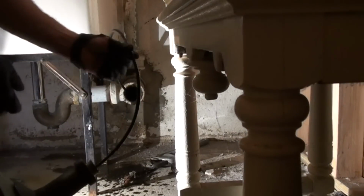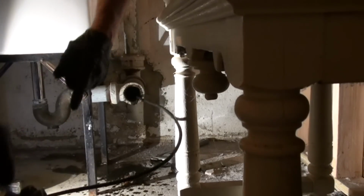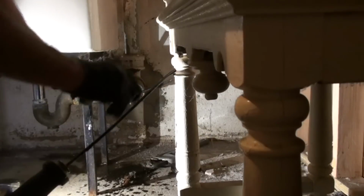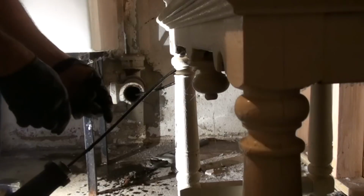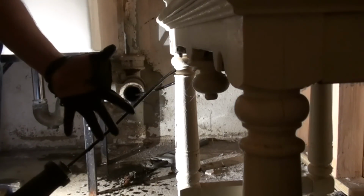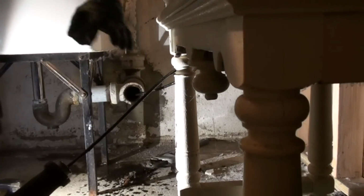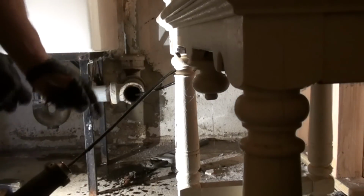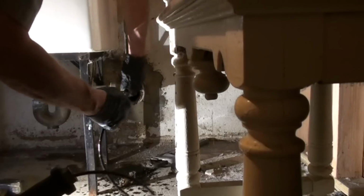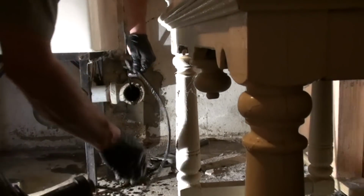It's totally filthy and covered with greasy chunks of drain crap. So I don't want to stick it right back into my machine drum. What I'm going to do is take it out and coil it up. I'm going to make my way outside without dripping it on their floor or rug. I'm going to find a garden hose outside and rinse it off before I stick it back in my machine. Or else the next house you go to, you're going to be shooting little pieces of this dried grease all around where you're working. So let's try to neatly get this thing out.